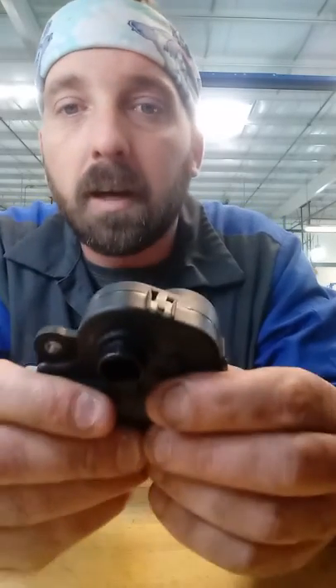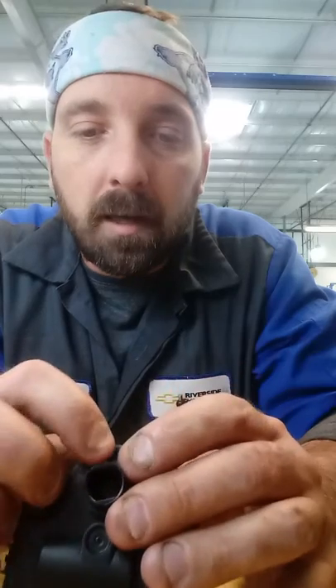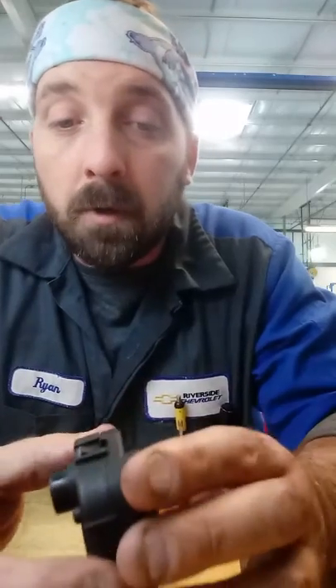Before you do that, keep in mind your mark of your position, which will be a line right here. There'll be a line on your shaft here. You want to take a marker or a highlighter and mark the position of it, or scribe it to keep it in the same location — that'll be important for when you open it up inside.